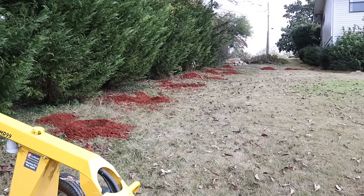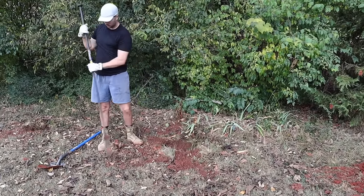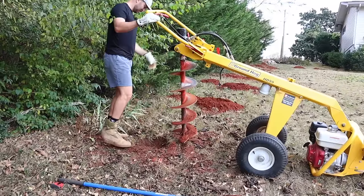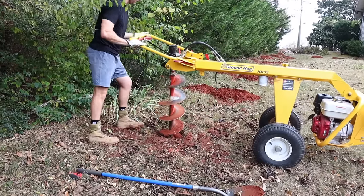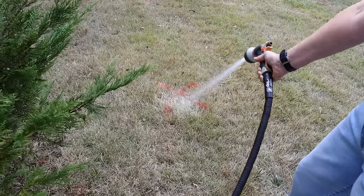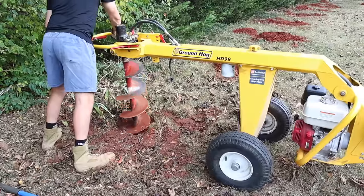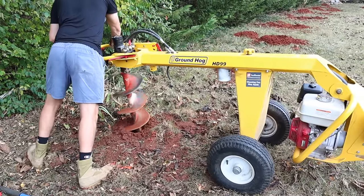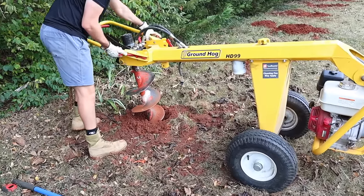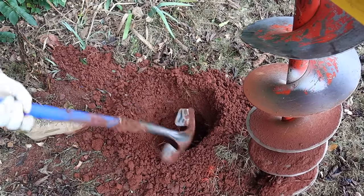Because Christian is my husband, he was going to do it himself. We rented a very large auger — basically a hole digger — and then learned that Tennessee soil is very clay-like and hard to dig. The auger couldn't handle it, so we had to soak all the fence post spots with the hose overnight. He had to dig 42 holes, all about 20 inches deep. He used a giant staff to jab into the ground to break up the clay and shovel it out. It was a whole ordeal — blood, sweat, and tears.